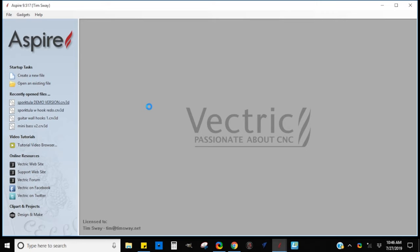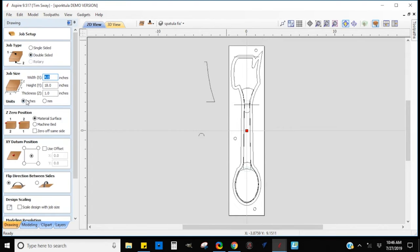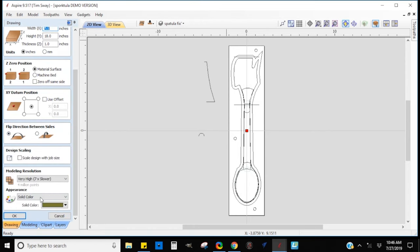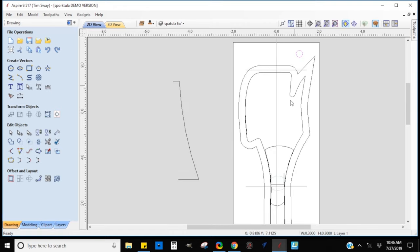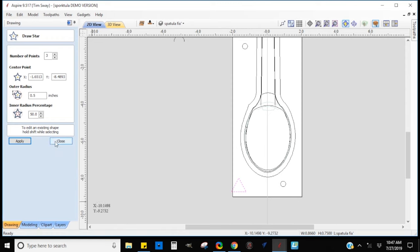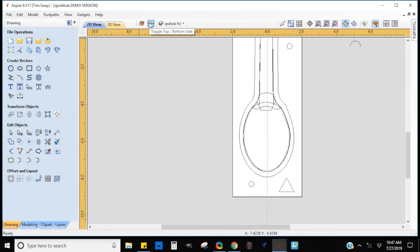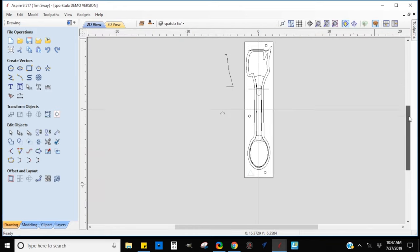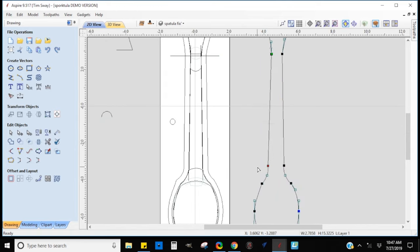Let's look at the actual Aspire file itself and I'll show you how I made it. There's the block of wood I created — four by 18 by one — and I've already done my geometry with all the shapes drawn out. I created three circles as guide pins: some go into the wood and some into the waste board, and I'm mirroring them onto the back side so when I flip it upside down I can guarantee my position is correct. I draw a triangle, copy it to the other side as a mirror image, so it always lines up when I flip the pieces back and forth.